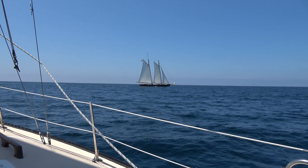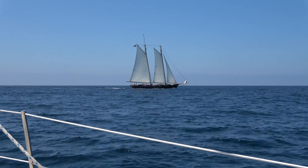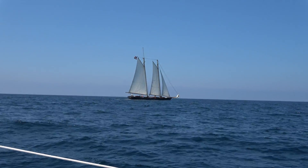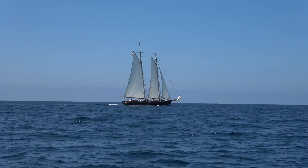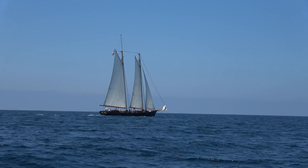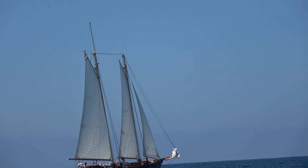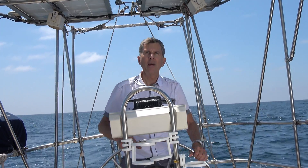If you're like me and most sailors, when there's any other boat out on the water we're racing. By understanding that because of apparent wind the wind direction actually changes with height, we are able to adjust the fairlead car to get the twist of the sail to match that wind direction change. That lets us go faster so we can win more of those races. Thank you for watching — I hope you enjoyed this video. If you did, please give me a thumbs up and subscribe.